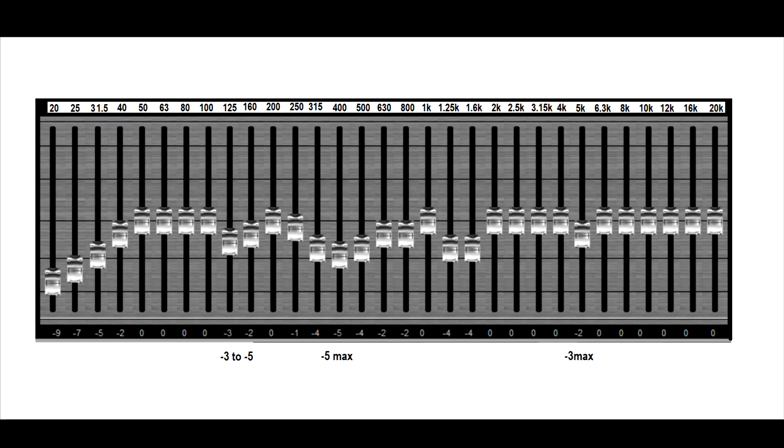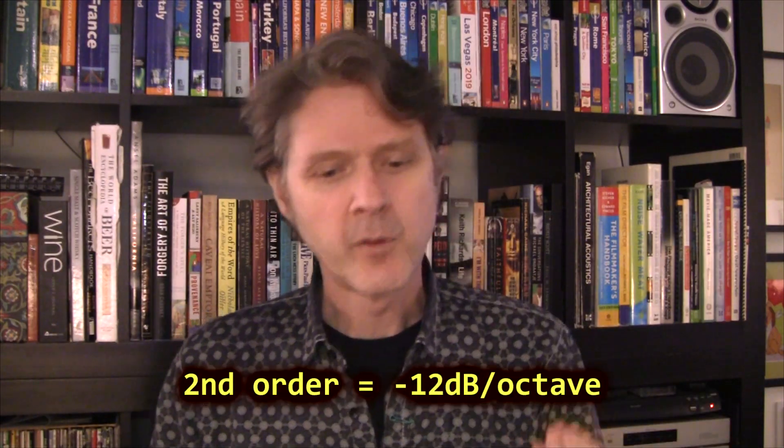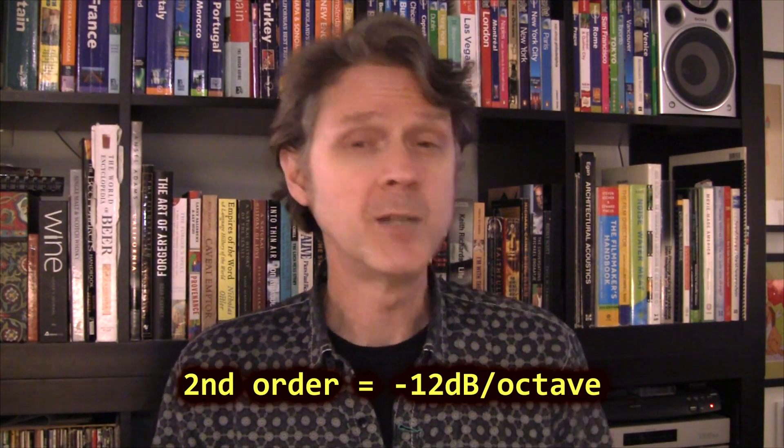Some sound systems I've worked on actually have no feedback, but they do need some tone control, which is why I take out the lower mids to clean up the sound. And I put a high-pass filter — about a second-order filter — starting at around maybe 50 Hz. Some people might say, 'Wait, you're cutting the bass.' I'm not. It's a second-order filter — I'm rolling off the bass. If a bass drum, bass guitar, or keyboard needs more bass, I'm using their channel for that, but I don't need it on the front of house.